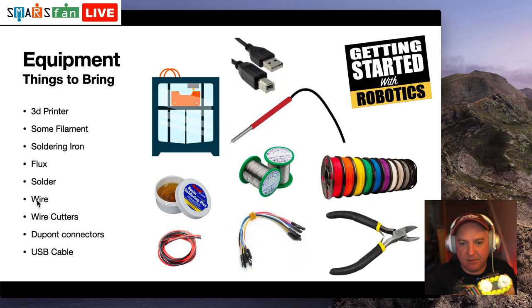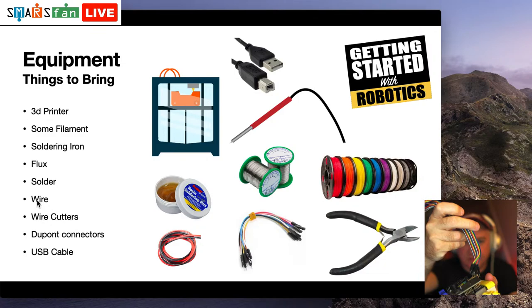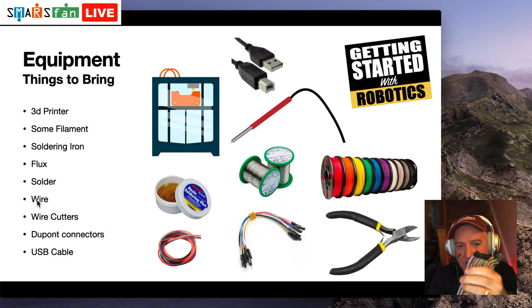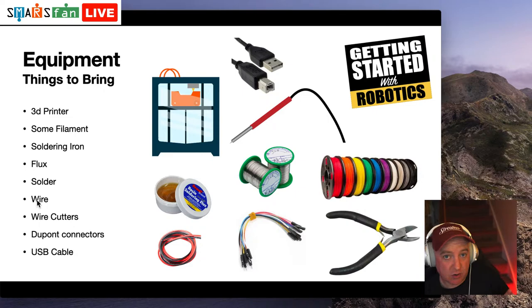So we need a male to a female, because we need the male ones to connect into the top of the Arduino, and the female ones to connect onto the top of the male connectors on the rangefinder. So we need some DuPont connectors. What happens is you can usually get a whole pack of every different type. They have long ones and short ones. You can use either type. The short ones I find are a bit too short. They're about 5 centimeters long, whereas these are about 15 centimeters, I would guess. But you can buy a pack that's got all the different ones in very, very cheaply.